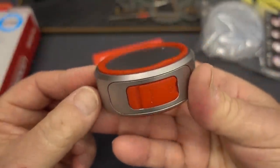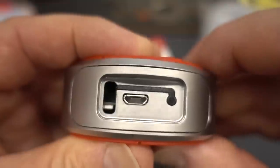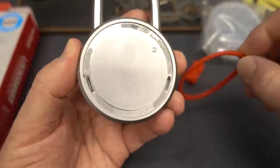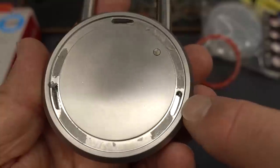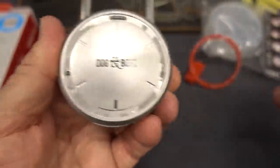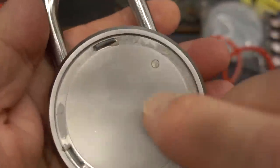Let's look at the lock a little closer. I've already shown you this opening — let's pull that off all the way to make sure there are no screws, and there aren't. There's no way to get access there. I'm also going to pull off these rubber covers, because a lot of times they hide stuff beneath the rubber. There are some small slots on the back — I don't know what they do, but this is not a threaded plate; this is all cast as one piece. Also on the front, it's just stuck on there with sticky tape, and it's got the same kind of slots. This also is not threaded. It looks like the entire locking mechanism was a module — they slid the entire module in and then pinned it.